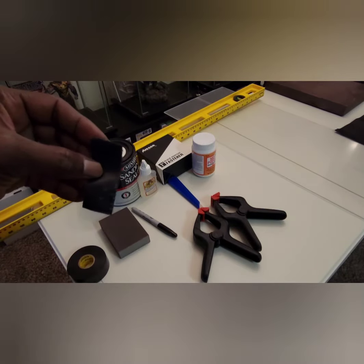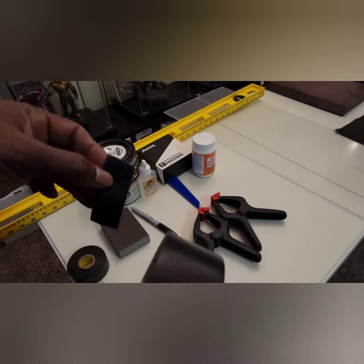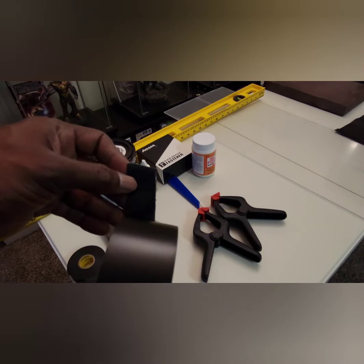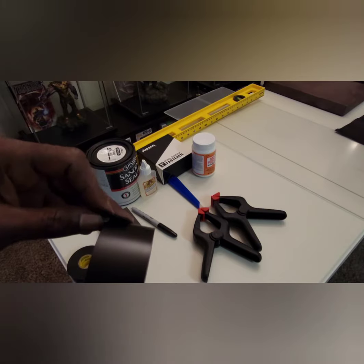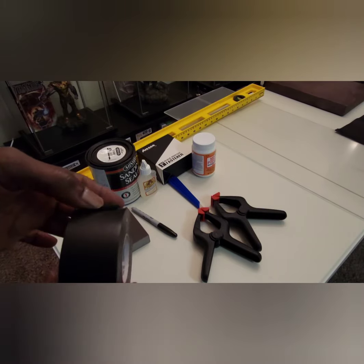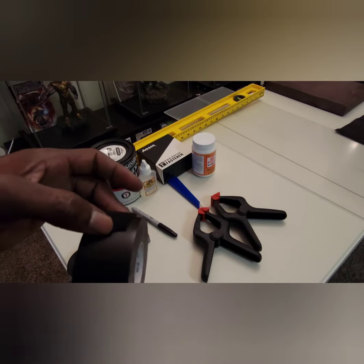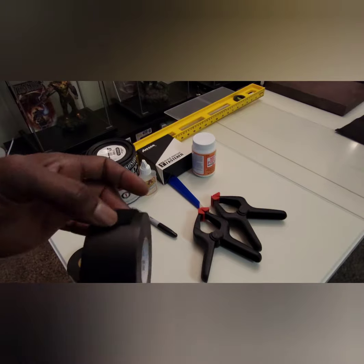So make sure that when you get the Velcro stripping, you get the 1-inch, so that when you put the trim around, the 1-inch is covered, so you don't even see the Velcro. The 1-inch is covered by the outside trim, so unless you tell somebody, they won't even know there's Velcro there.